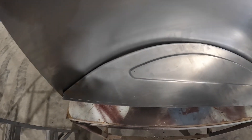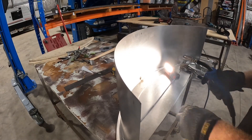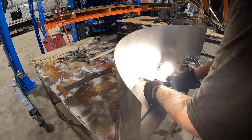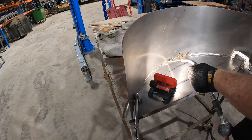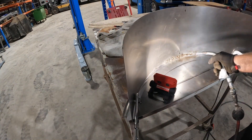I've got the outer piece rolled now. Just a bit of a mock-up here — you can tack weld it in the center then just push it into place from there. This center part's upside down just to get the right curve on it, which we've now got. We've just got one tack weld in the center and we start from there, tacking around each side while holding it on the edge. I'm only using 0.6 millimeter MIG wire on a very low heat setting.